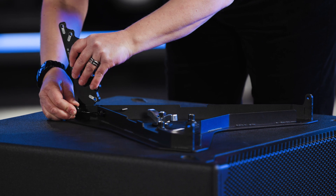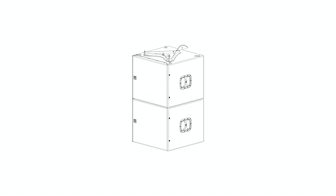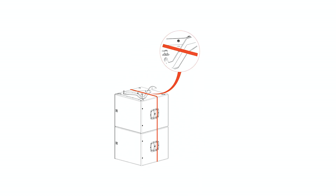Pin the angle selection pin to the rear of the base plate. If the subwoofer stack is more than one cabinet high, the cabinets must be secured together using a ratchet strap. The strap should wrap around the entire body of both subwoofers and feed through the ratchet strap channel cut into either side of the base plate.